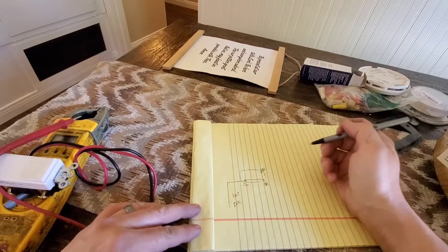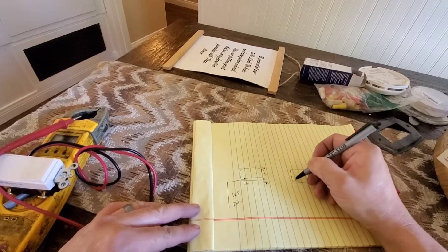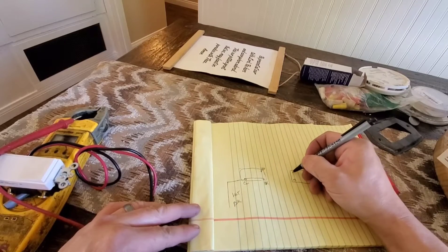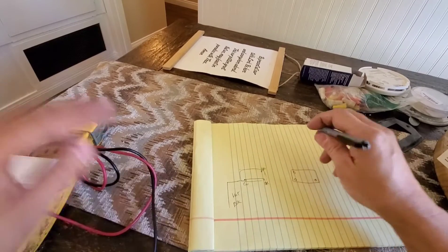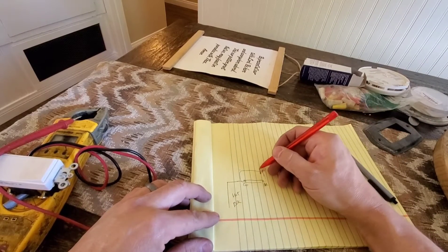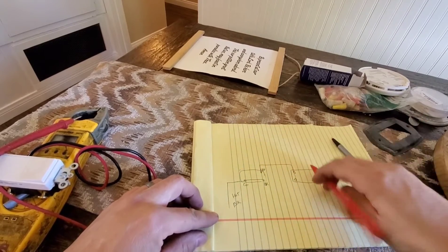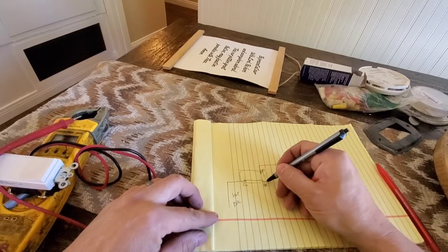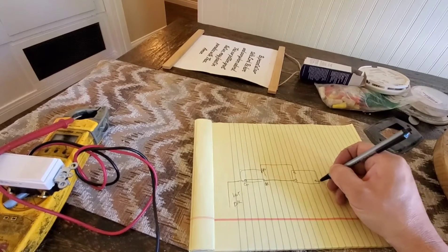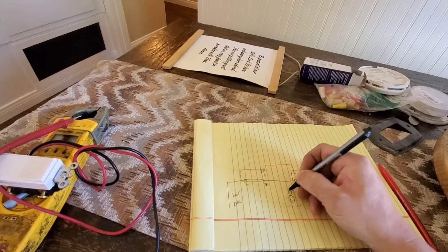Here's my first switch, and I'm going to have the other switch over here. I'm going to have my common on this side, my primary on this side, and my secondary on this one. So my red wire — that you're going to see inside when you're wiring it up — is usually going to go to the traveler side, where the black wire will go from primary screw to primary screw. Then we're going to have the other black wire coming out going to the light.